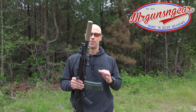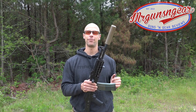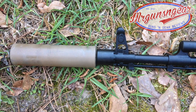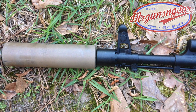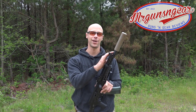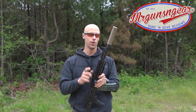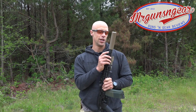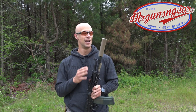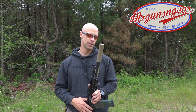There are more and more adapters coming out now. This is a 24mm gun, so this is a half by 28 inch AR threaded suppressor. Now these, I think, came from CNC Warrior, but there's a ton of companies now making quality adapters, so that's always a good thing as well. So for those of you guys that are running 14mm threaded guns or 24mm threaded, there are adapters out there for just about every type of suppressor mount going. So that is good. One note on that, when you thread down your adapter, make sure you crank that thing down so there's little to no play in it. That little bit of wobble in there can be the difference between a baffle strike and blowing out the end of your can. So we don't want to do that. That's something to keep in mind.